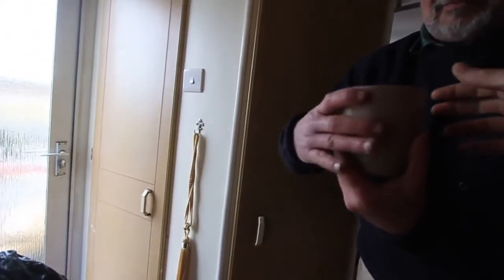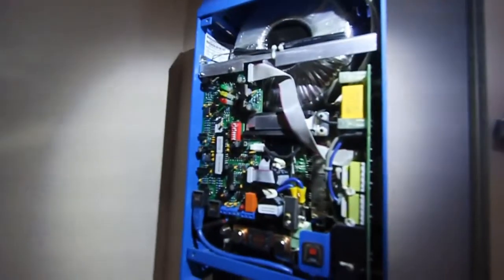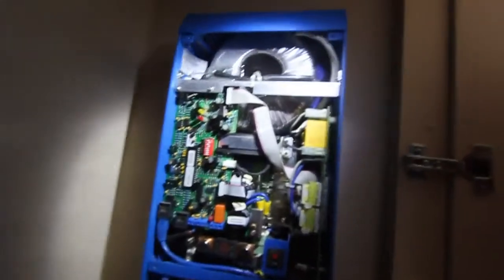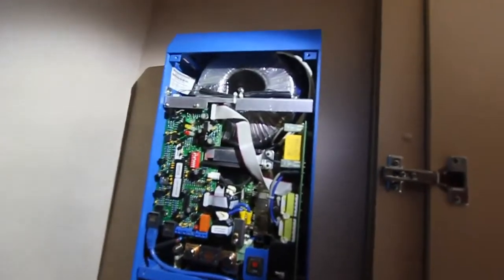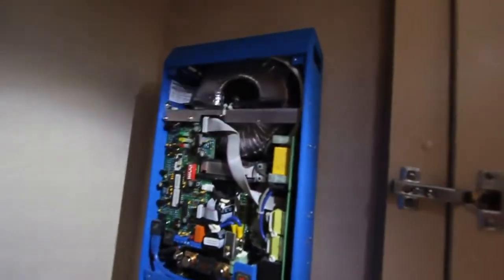And here is the landlord. It's actually hot here. Time for a commercial break now, make some money for us. And here is the booster — there's the main man. So here is the Victron Multi Plus inverter charger with nominal power 1.6 kilowatt. This inverter charger, as the name suggests, can invert and can charge. That means you can charge batteries also using an external generator. And what we have here that's interesting is a relay.